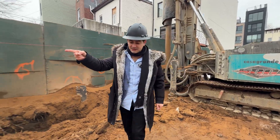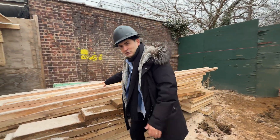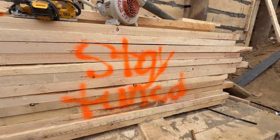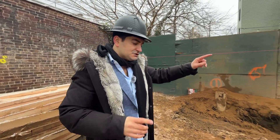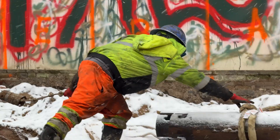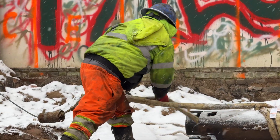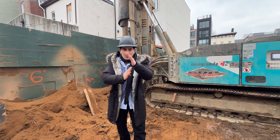We've already ordered the lagging. Behind us is the wood timber we'll be using — not two-by-four studs, but big Douglas fir timber, thick and strong. That lagging will be installed simultaneously as soon as the piles are finished. Remember, we're going down 16 feet total, and when you're going 16 feet, you can't do just one section — we're underpinning both sections simultaneously. Strategy, guys.